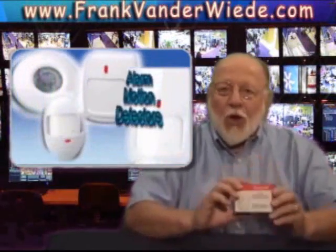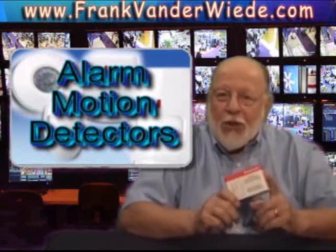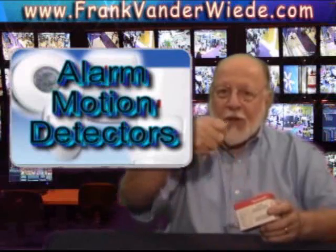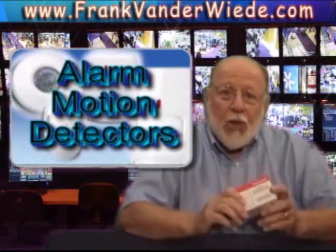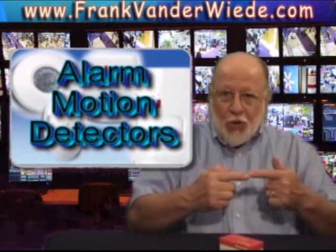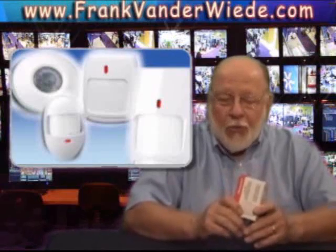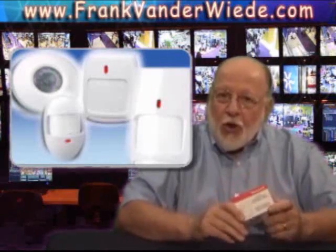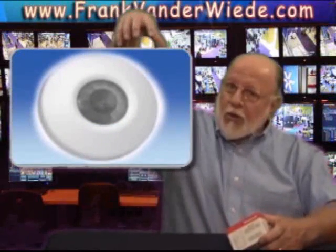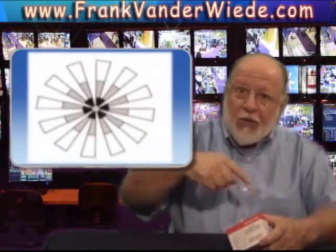Let's move on to motion detectors. A motion detector is considered to be a backup to your window and door sensor. You want to locate it in a likely traveled area. What that means is that if a crook was smart enough to break the glass out of the window, climb through that hole in the broken glass, and not physically open the door and walk in — where would they most likely go? Certainly between the master bedroom where you hide the jewels under the mattress and the family room where the DVD is. If you can find an area in between those two locations to mount your motion sensor, it's very likely that you're going to catch this person. Motion detectors come in a couple different types: corner mount, wall mounted, or ceiling mount are the two main categories. A ceiling mount would get mounted like a smoke detector, usually in the middle of a big room, and it could broadcast a big circle of protection. Anybody coming from any direction would break that circle and set the alarm off.